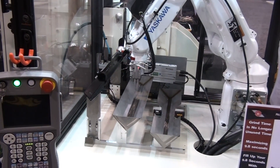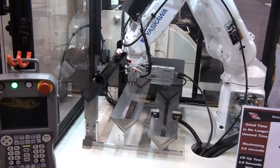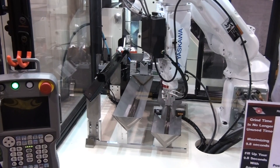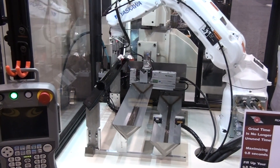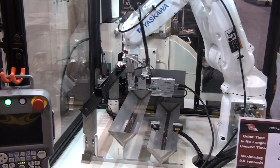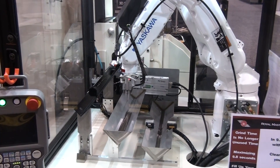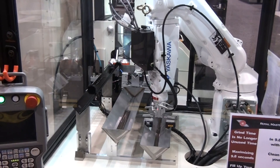The wheels are dressed with the taper form of up to 8 inches long. The insert blade is sized on the machine to final dimension using the servo-driven RAM bed position control in auto blade sizing mode. The robot moves the vacuum pick with gripper fingers through the motion to select a singular wire and position it in the ready position.